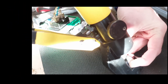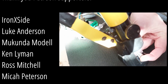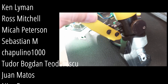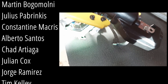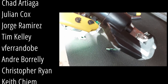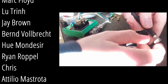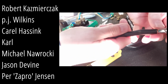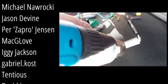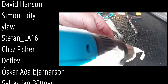Whilst the cells are charging, let me show you a couple of fixes I've made to the battery. The first is to improve the negative power terminal — in the original build video, this cable was at an awkward angle, so I bought some 90-degree crimp connectors, which has improved the orientation of the cable and removed that nasty bend. Whilst doing this, I also noticed the positive terminal post was actually slightly loose. I had noticed that the positive cable got very slightly warm whilst the negative was cold to the touch. Sorting this out means both cables never get warm now, even at three kilowatts running through them.